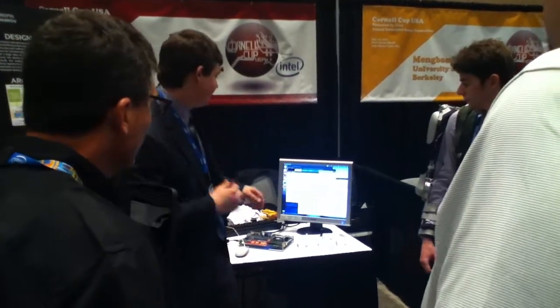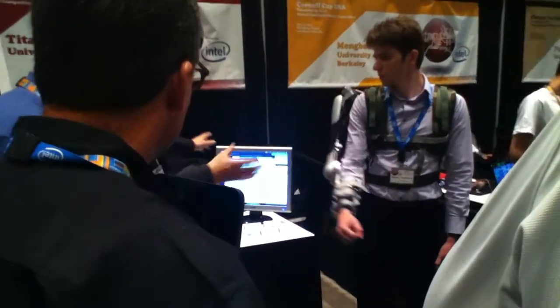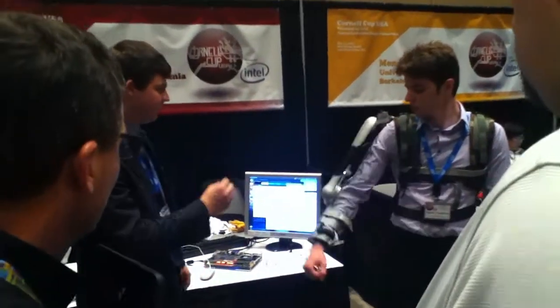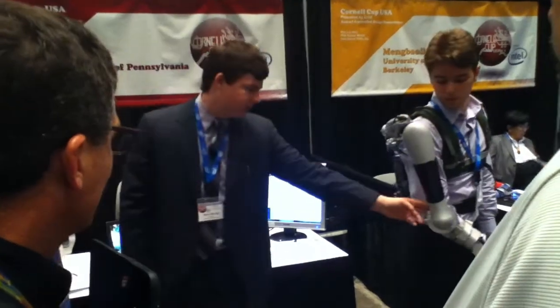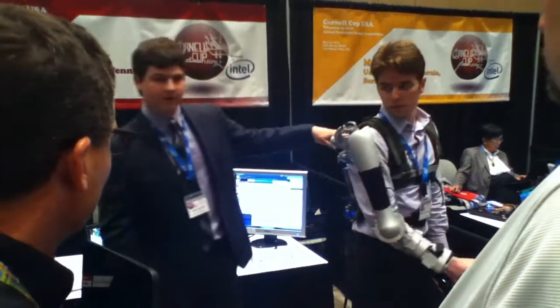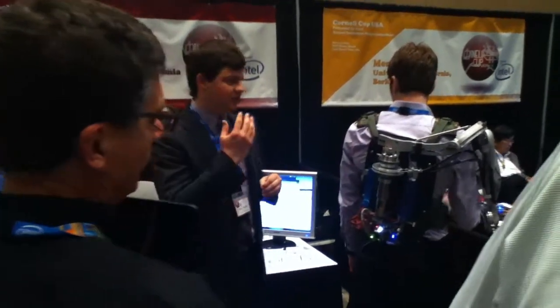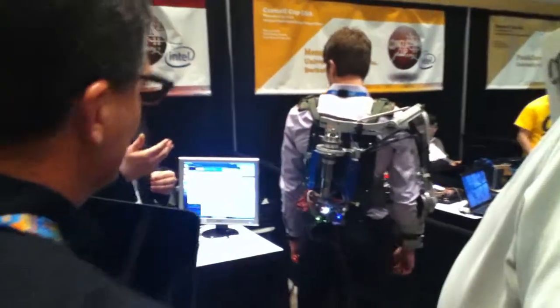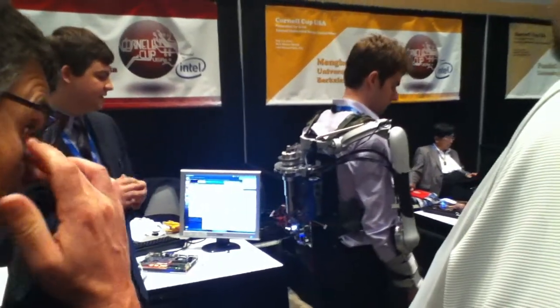Here's data we were running the other day. Right now you can see the elbow joint responding to whatever Nico is doing. We have hall effect sensors on each of the joints — the elbow joint out here has one hidden in there, and our shoulder joint right here. We have a rotary potentiometer to get absolute encoding for the motor. This is important so that when we implement our software stops, we know where we are at all times — it's not just an incremental increase.